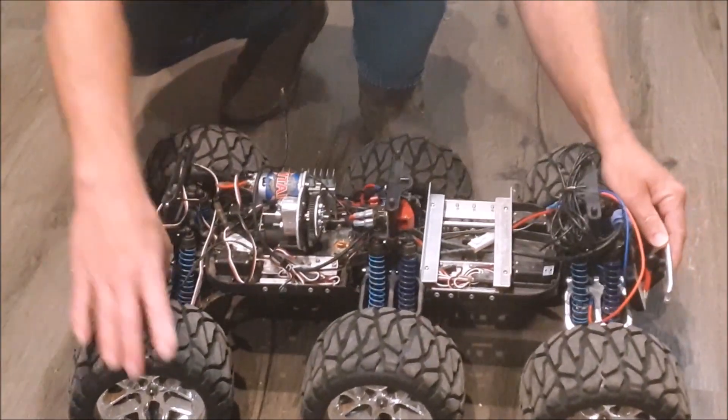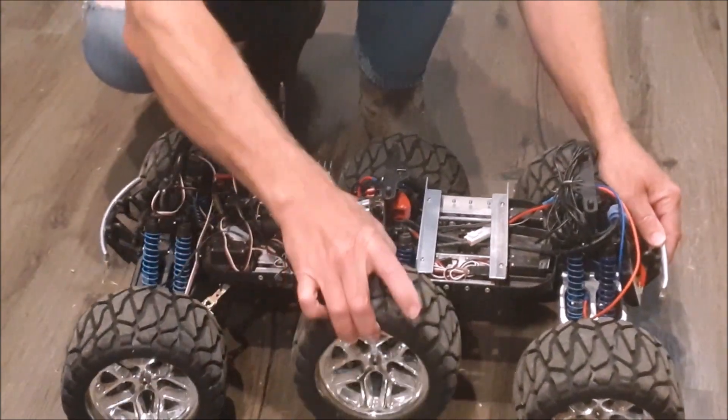After that, the only other mods I made were in fine-tuning the shock absorber oil and the spring rates at the six wheels. This ability to tune the suspension over such a wide range is what really ended up making this car such a good candidate as a robotic vehicle. Even though it was not what I originally intended for the vehicle, it has turned into as robust, reliable, and capable a platform as I could ever want — serving as a test platform for proof of concept for my navigation systems, onboard electronics, and GPS package.